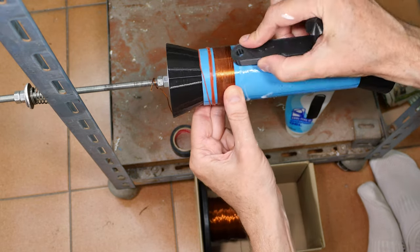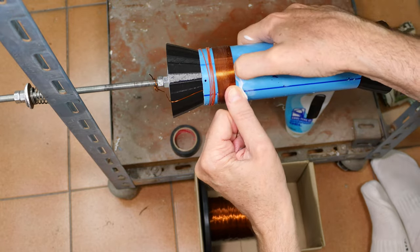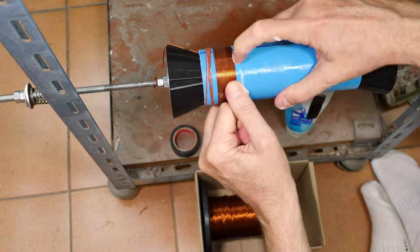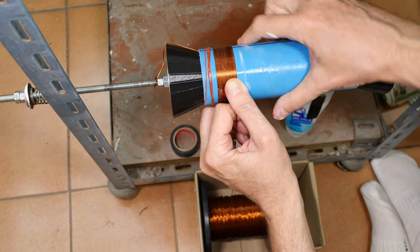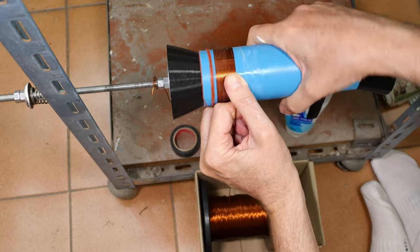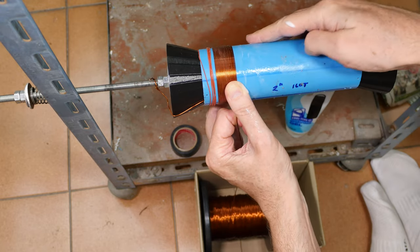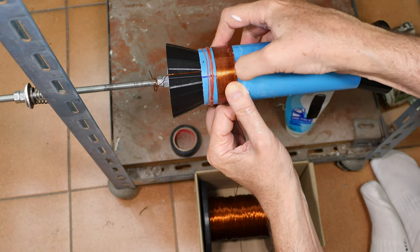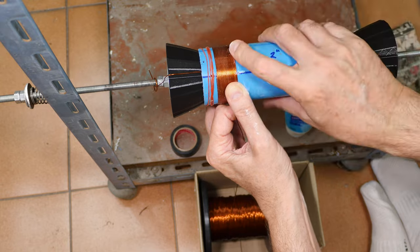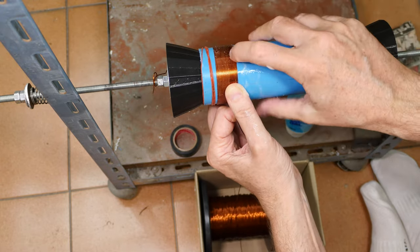Well, there's the departure. Don't want that. When you're using glue, you have to keep moving or the glue will start to dry and ball up on you, like it is out here. And if that gets underneath the wires, yeah, that becomes a headache. So I may have to stop and wipe this down. Get the glue balls off of there.